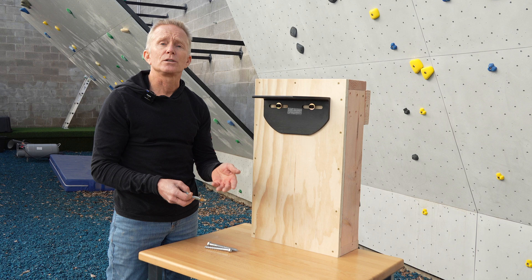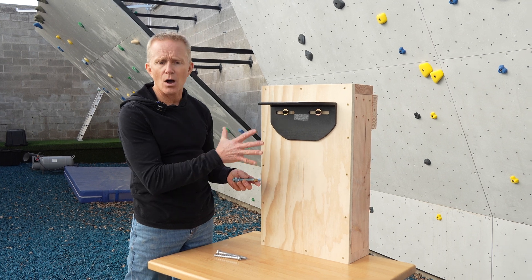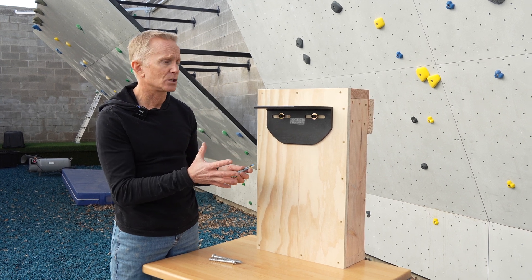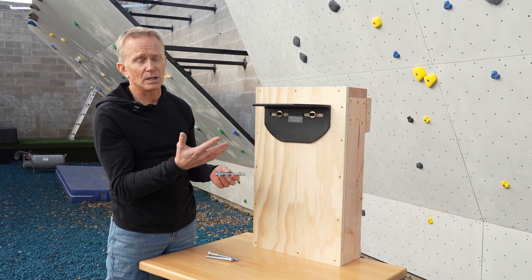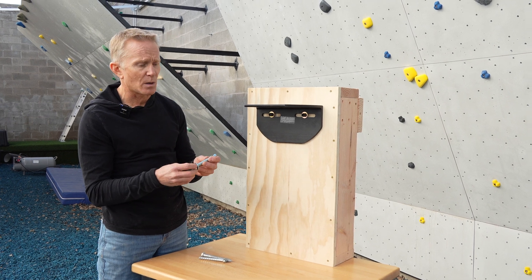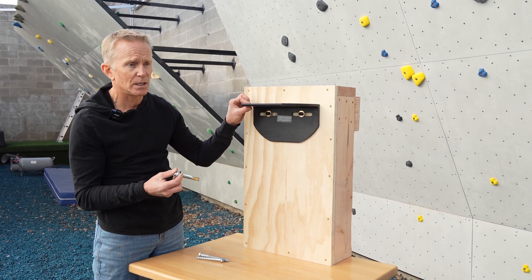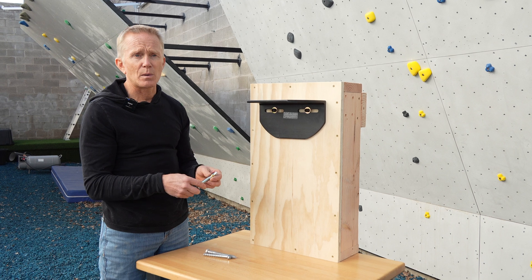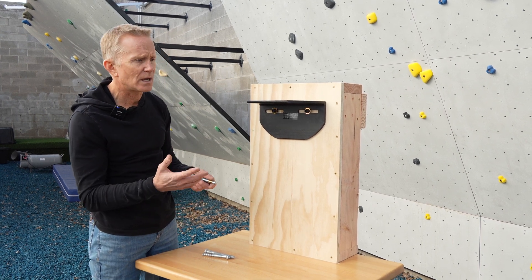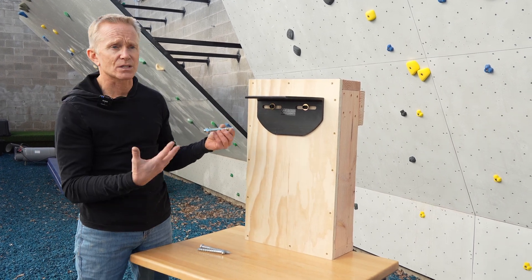If you're going into solid concrete or rock, the hardness of the rock determines the diameter. The softer the rock, I always go with half inch — and it would be stainless steel for everything in an outdoor application. On a concrete wall indoors you could use zinc; outdoors, stainless steel. To go into solid concrete, use a minimum length of a four-and-a-half inch bolt, since the plate is just over a quarter inch thick, to achieve proper embedment. I would recommend a half-inch wedge bolt. There are many different kinds — Powers Fasteners is a very common one, and there's also Redhead. You need to look at the specs to make sure the tensile load can handle this kind of application.